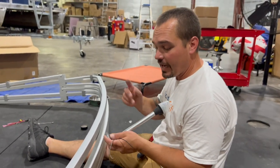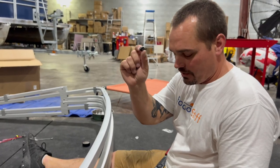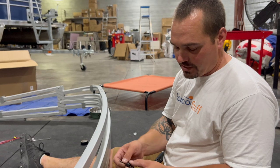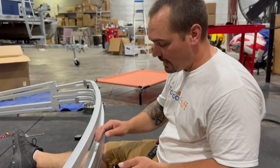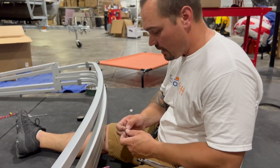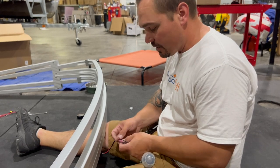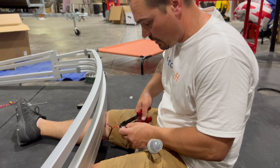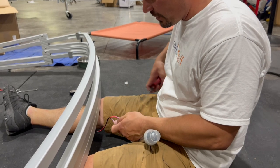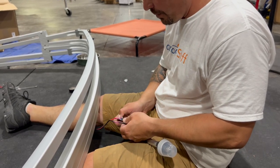We are reusing the stern light that was on the boat before. Before I splice these in, I'm going to use this plastic grommet — it's a wire protector — and thread it on so it can slide into the half inch hole that's in the bow. Now I'll go ahead and splice. I have a gray wire and a black wire. Typically, black goes to black — black is almost always ground in the marine industry. Your other colored wire, whether it's white, gray, or red, that goes to the red wire, your power or positive wire.